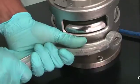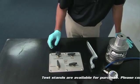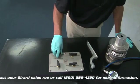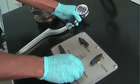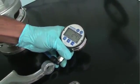First thing you need to do is make sure it's tight on your 3-inch adapter. You're going to bring up pressure slowly and you're looking at your gauge at all times. You want to make sure it cracks at 30 psi, between 30 and 33.